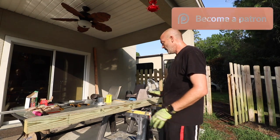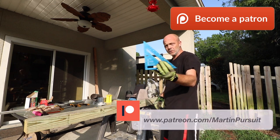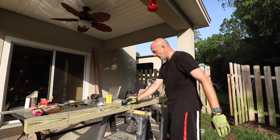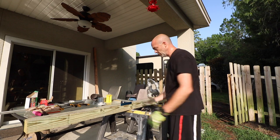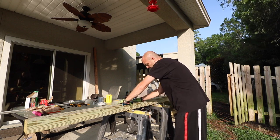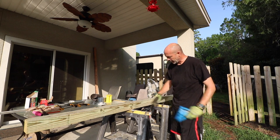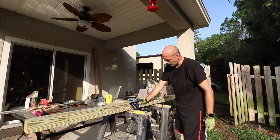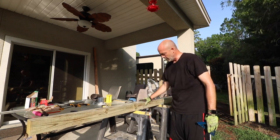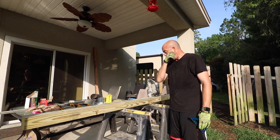I don't have a 12-inch push-pull miter saw, so what I've been using is just a speed square and my circular saw. Basically, you hold your speed square up against here and that becomes your fence for your circular saw. Once you hold that up, you line up your blade with your cut mark, and to get through a post like this you're going to end up with three lines. First was the line you marked with the jig, then you transfer that over with your speed square to this side. That allows you to make one cut down this side about halfway through, then flip it over and make a second cut through this side to take the rest of it off.